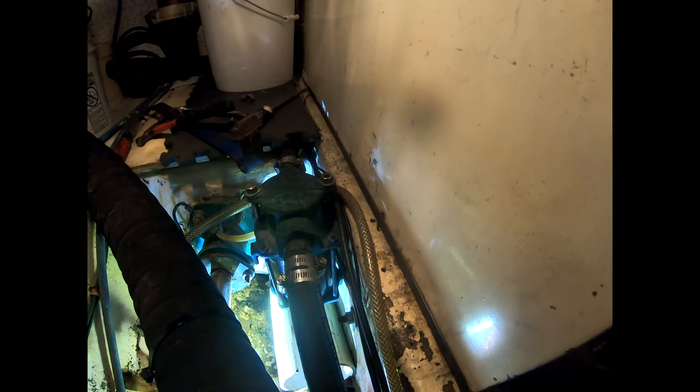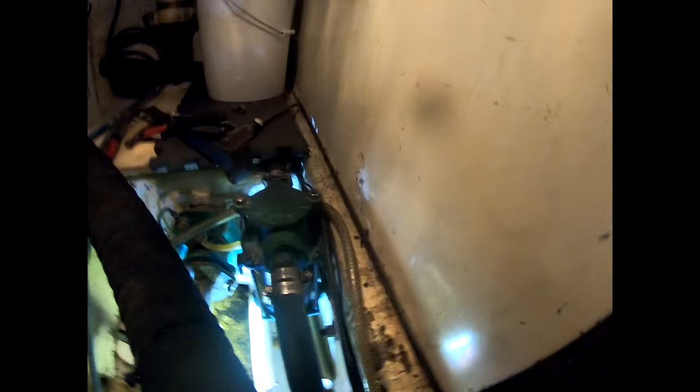This is all I've ever owned — I've never owned a boat with dripless shafts. I've always had these drip-type shafts and I've really not had any problems with them. Another thing I'm going to do while I'm down here: let's go ahead and clean the AC strainer. I'll go shut all the air conditioners off, then turn the valve off, pull the strainer out, and see what kind of trouble we're in.